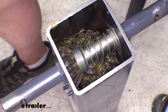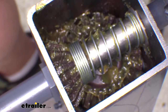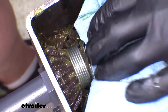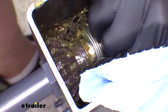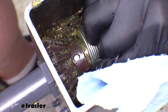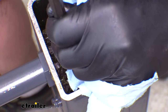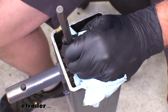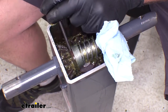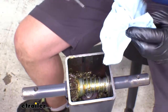We need to pull that spring back and we'll be able to see a pin underneath there. Have handy a 7/32nd or 5/16ths punch — whatever you've got. Pull that spring back and let's see if it's in there. There it is right there — it's that little pin. We'll take our punch. Sometimes you can move those by hand; this one seems like it's going to be a little tougher. Just get that started, then rotate it and continue to punch it out. Use a pair of pliers and pull that out, and set that aside for now.